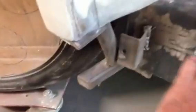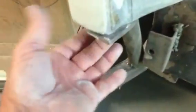I put my front fenders on. You can see back in here I have a screw that holds it here. The cowl piece gets held with this, the ball stud for your joint. And down here at the bottom, the front quarter has a flange on it. You put a piece of 1/8" FRP for your little black spacer, and then the rocker panel comes in there too, and it's got a tab here, and you just come to your wheel well and you bolt that all together there.